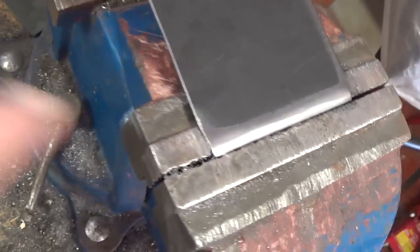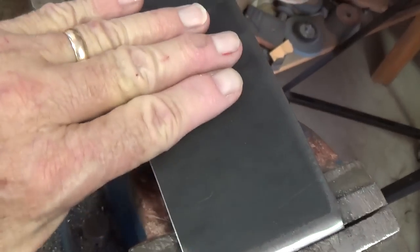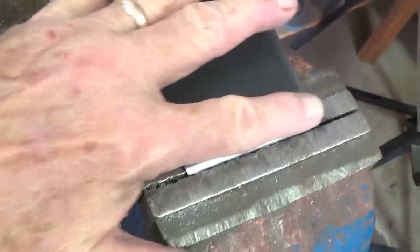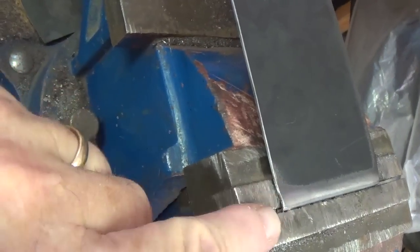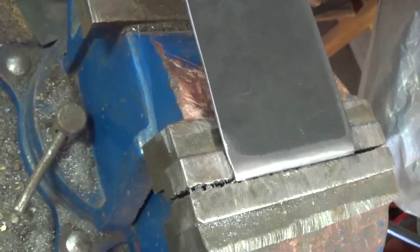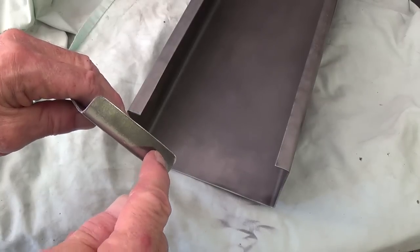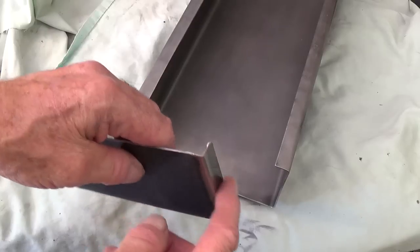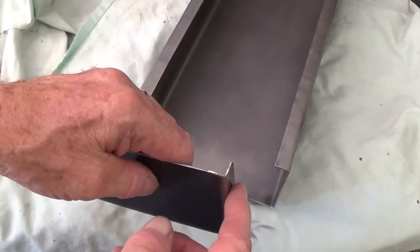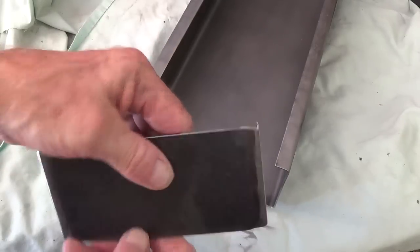Here's a quick view of how I made the side pieces. I just pinched that half-inch in the vise and then, using a block of wood and that big hammer, bent it over and tapped it down so that I have a nice 90-degree bend for my quarter-inch flange. There are all different ways to install them — if you have a drill, you can drill holes for nuts and bolts, pop rivets, or silver solder. In my case, I'm going to actually weld them in, and I'll show you how that looks once I install this one.